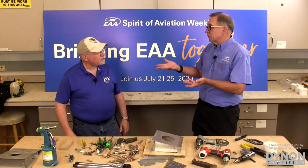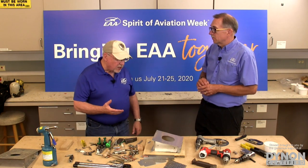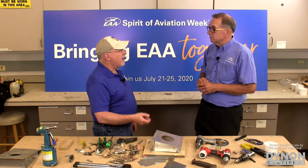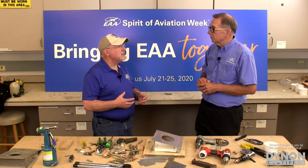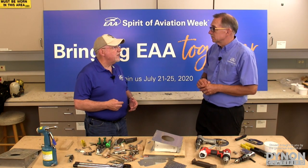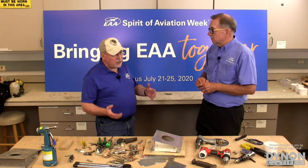In fact, some people, as you mentioned, don't even do any corrosion proofing. Especially some of the aircraft are built out of 6061, like the Sonex, for example, and that's very, very corrosion resistant. So unless you're in a very caustic atmosphere, like coastal cities or a high industrial atmosphere, the airplane's going to last many, many years. So keep that in mind as well.